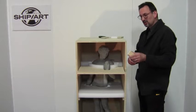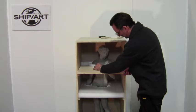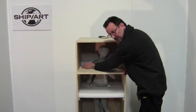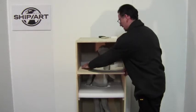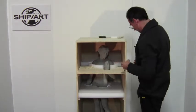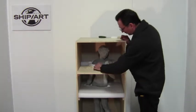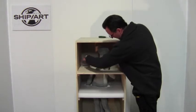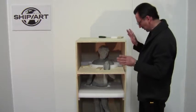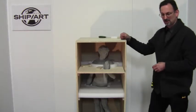The nice thing about this is since you have a glue gun, you basically can do any adjustment that you want to do. Either you can push it a little bit if you want to move the foam that way, you could back it up a little bit. So the foam will give up to a certain point and then stop. And the idea would be you'd get all this figured out and basically glue these in place before you screw them. So you just put a shot of glue on there, push in place, a shot of glue on there. You get them all stuck on there. It'll hold it in place for you. So you then go back with your screws. So you get the best of both worlds. And so that's kind of like what you're going to be doing in a normal situation.